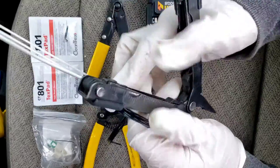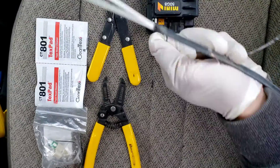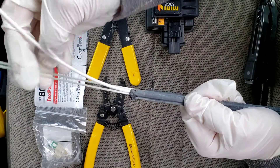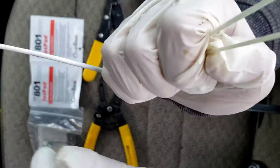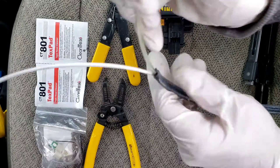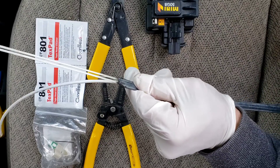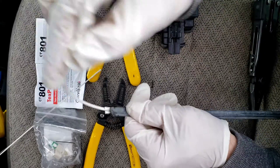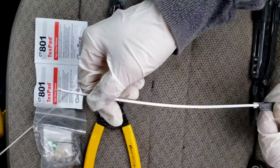If you have a knife available, you can also just cut it off with a knife. Now our fiber drop cable is down to two fiberglass rods that are very stiff and one white core that is very flexible — that's our fiber optic core. So we can cut off these two hard rods, once again using pliers or side snips. Now we're down to this white core; we have now stripped the outside of the cable.